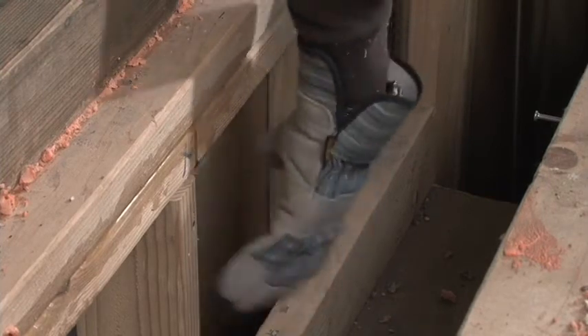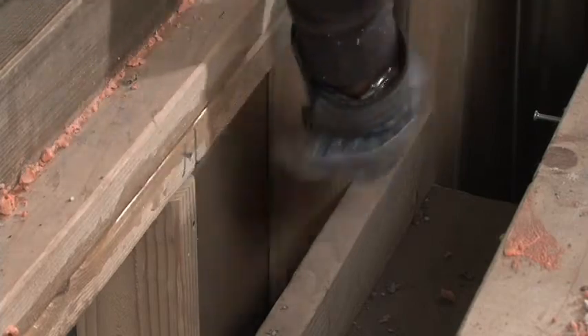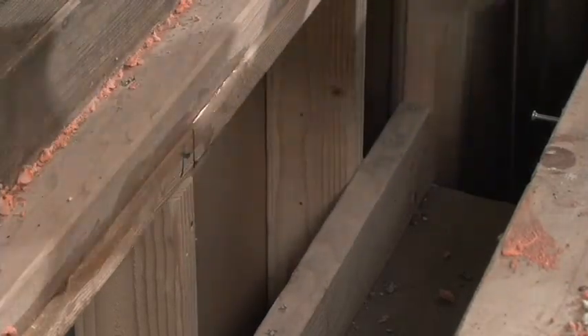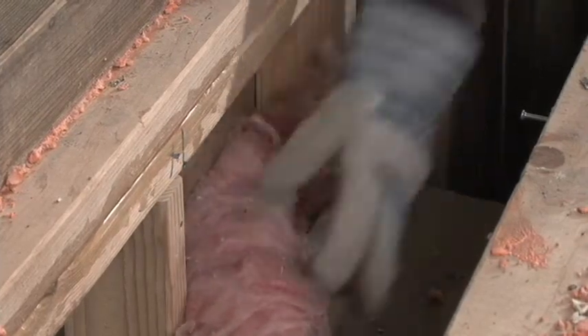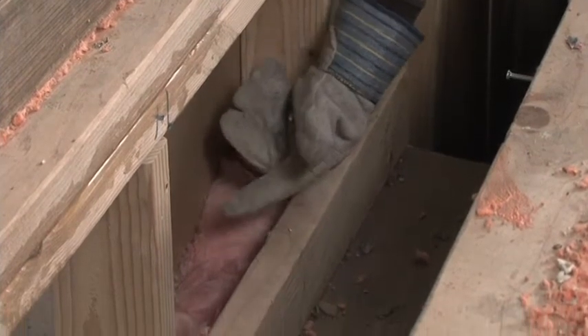There are two ways we go about fixing that. The first is to cover the top of the drop soffit from the attic and insulate over the top of it, making sure that it's air sealed very well. The second way is to actually insulate the walls inside the drop soffit. We fix that by taking some fiberglass insulation, rolling it up really tight — burritoing it — and stuffing it into that hole. Now the air that's underneath, although it's being warmed by the house, cannot make its way into this drop soffit and out into the rest of the world.